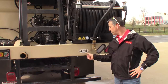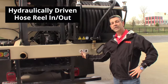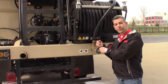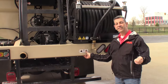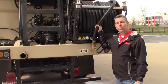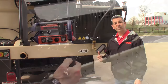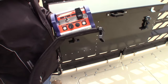Here at the back of the machine, we have a hydraulically driven hose reel for retraction in, as well as out to assist so that someone doesn't have to pull the hose. You can push this button to facilitate the operator easily getting the hose out as far as he needs — 200 feet or more, depending on what you put on here. We also have a remote control, and that operator will be able to do all of those things with his remote.